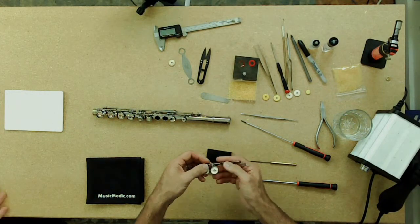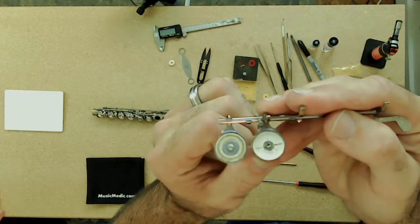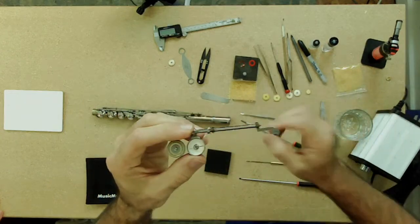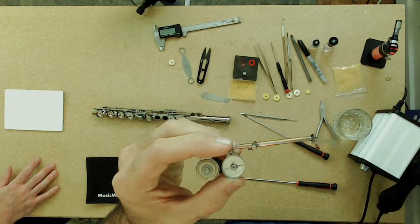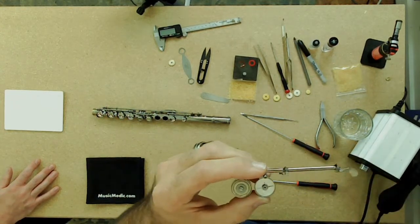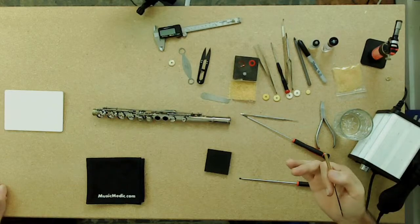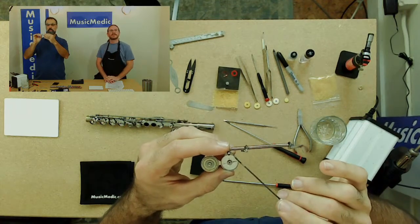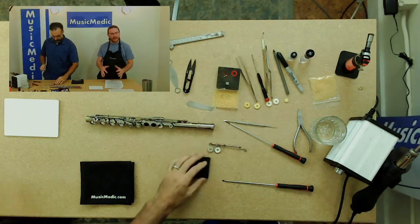I want you to look at one thing here. That white part in the back is a paper shim. If you look really carefully, there's a mark on that shim on the back side — I put that in there with a regular pen. What this does is, when you're shimming, you want to eliminate as many variables as you can. That mark will tell you beyond a shadow of a doubt which way that shim goes back in there if it falls out, so you get that orientation correct.